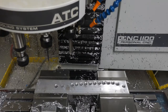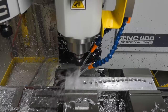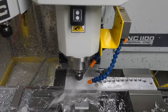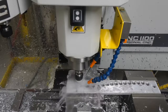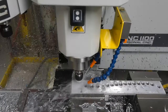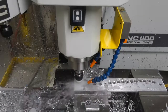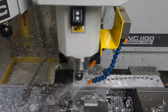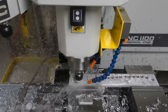Okay, now we're going to do some serious milling — well, just aluminum. Full depth, 3/8 inch, 6061, with a 3/8 diameter, 3-flute Lakeshore Carbide cutter, zirconium nitride coated, at 3,000 RPM, 5 IPM plunge, 7 IPM cut, full depth. Not really straining the machine a lot, not using a lot of spindle horsepower, not chattering. I can probably push it faster. The coolant system seems to be doing a good job of keeping the chips under control.